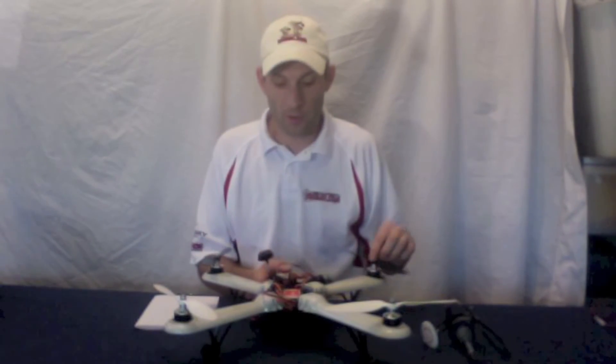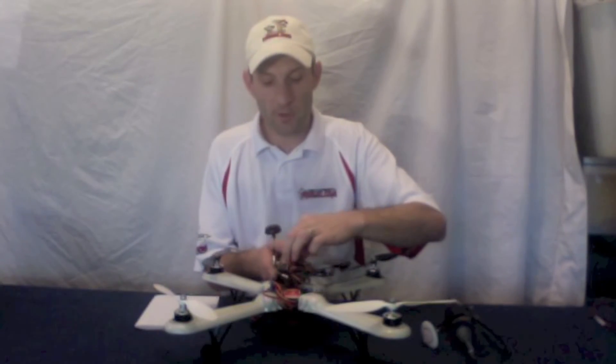The rate wire goes into U and into your aux — you want it on a three-position switch. If you don't have a three-position switch, you can put it in a two-position switch like gear on a DX6. But you really want a three-position switch, so I have it going into my aux for my DX7.